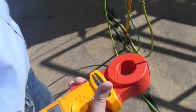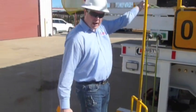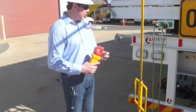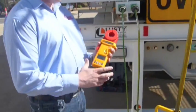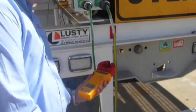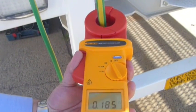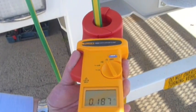Now that we've done that, we can verify that the meter is reading accurately. We'll test the earth loop to ensure it falls within the guidelines. An acceptable reading for earth loop resistance is 0.5 ohms. Starting with the main earth, we clamp the meter around the main earth cable and verify that the resistance reading is lower than the required 0.5 ohms — so this is acceptable.